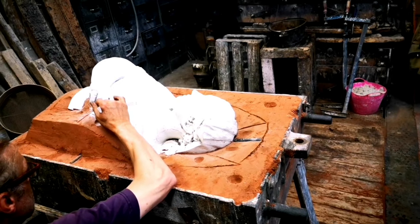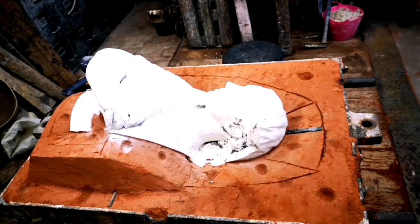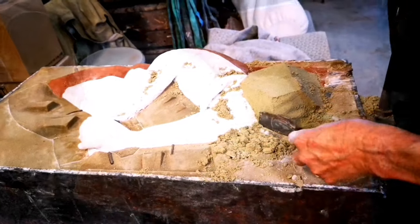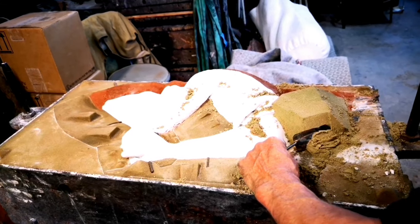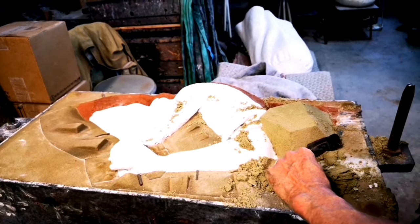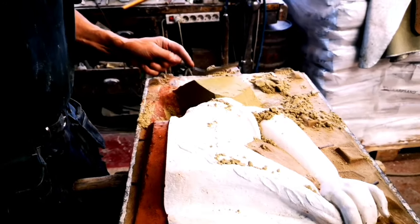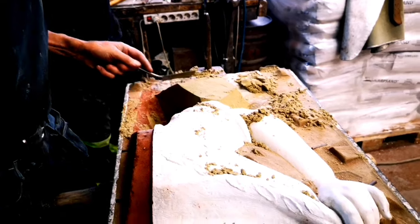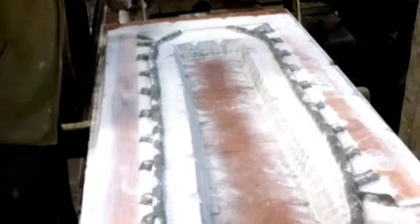The sand mount, usually done with oil or water-based sand, decides where the parting line goes. The two master halves are important since they control all the work going forward — done poorly, the mold might need to be broken and redone from scratch, or at least the work becomes a lot harder. When the parting is decided and done, all the pieces of the first half, the cope, have to be created and must all be able to be removed. This is also the time to create the runners for the first side of the mold, usually done with clay.